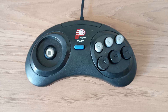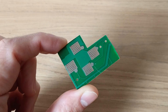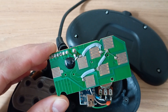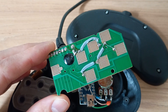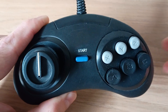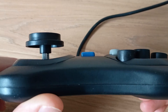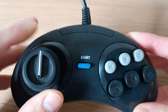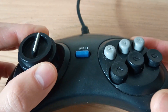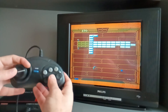Then it was time to put it inside the Mega Drive controller shell. I had to cut the board in half and remove the D-pad portion. I also soldered all buttons in parallel, except for the start button, so all of them have the same function now. I even found a large knob that is the same size as the space for the original D-pad. The potentiometer shaft is a bit long, so it sits a bit far from the controller, but it provides a nice grip for the fingers. And here it is, working flawlessly with my Brazilian Master System.